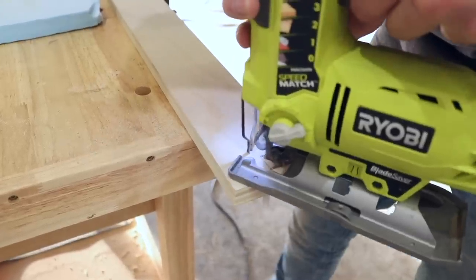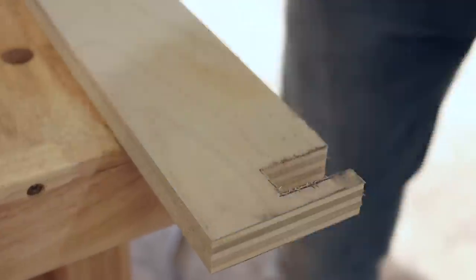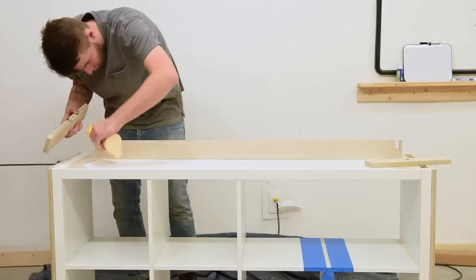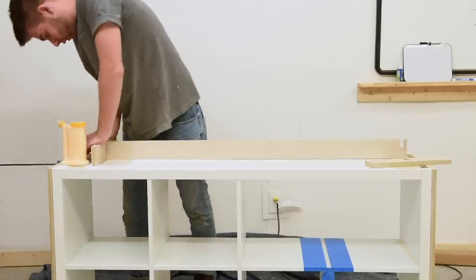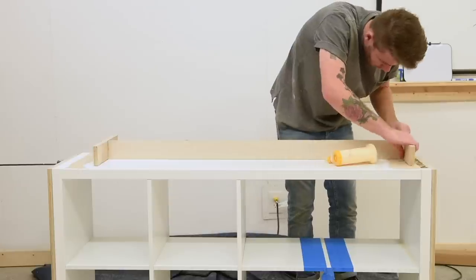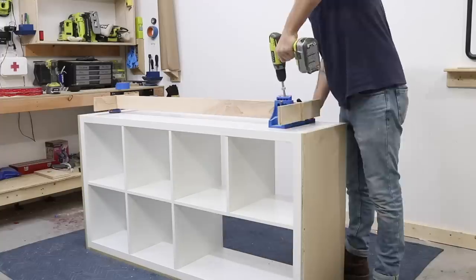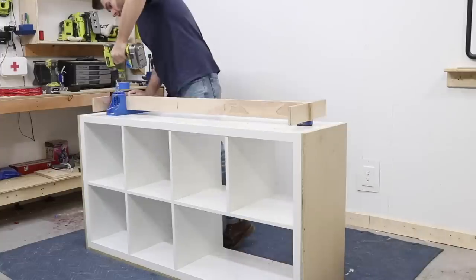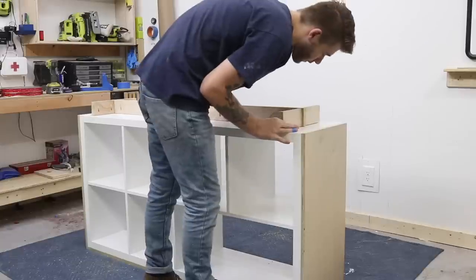On my horizontal stretcher, I cut the opposite side out the same thickness as my sides. That way, whenever I put my two pieces together, they would sit flush and be interlocked. This makes for a really strong joint. Once the glue dried on the base, I got my pocket hole jig out so that I could attach the base to the cabinet without any of the screws being visible. If you don't have a pocket jig or don't want to buy one, no biggie — you can always screw from the inside of the cabinet, but people are going to see how you attached it.